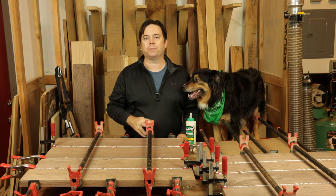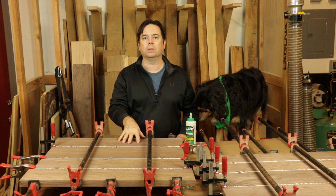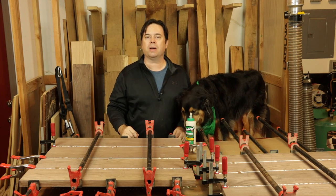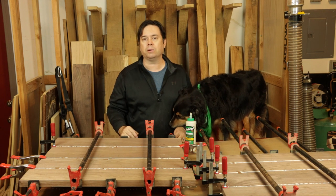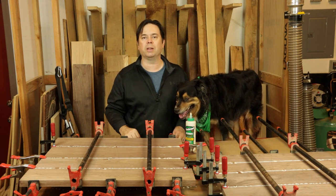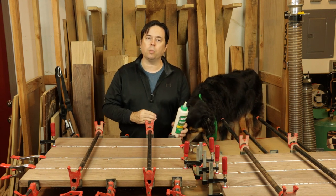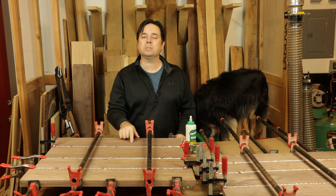With the walnut panels, it's a little different approach. We're going to glue them up all in one continuous glue-up — four boards glued together with wet glue lines. Since they're wider than our planer, we're just going to dress them down at the drum sander. With a Laguna 1632 Supermax drum sander, it's pretty easy to handle wider panels — you just select the right grit, maybe start with 80 grit, then work your way down to a smoother grit, and then a little random orbit sanding to finish up. As far as glue, we're switching to Titebond III. The maple panels used Titebond II. I used Titebond III for walnut — not because of waterproof characteristics, since this is an indoor piece — but actually because Titebond III, when it dries, more closely matches the walnut color.